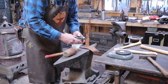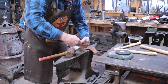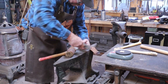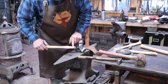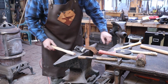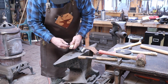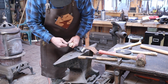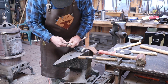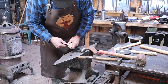In this case, I can take the drift that I used making the hammer. So this tells us where the hammer fits and where the hammer doesn't fit. And anything that is being compressed here or leaves a really bad black mark is where it's too tight. And I tend to go to a sharp knife at this point and just do little bits of adjustments.